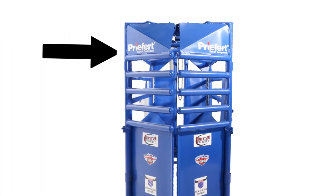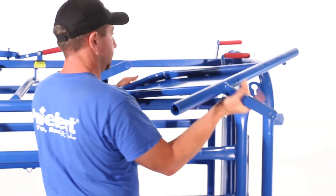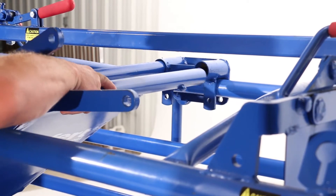In this scenario, we're referencing the right side of the chute as what would be the steer's right side when loaded in the chute. Now, position the U-shaped pushing panel inside the chute with the sheet metal side facing the tailgate. The top bar should slide into the open collar on the operating shaft.